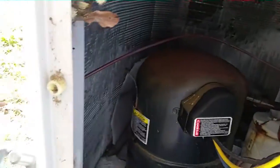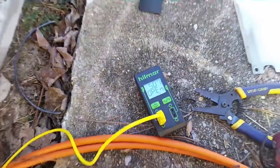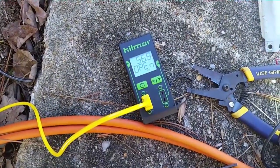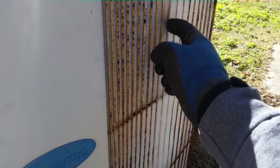There's still a lot of ice on the outside just because it's accumulated so much. On the inside you can tell some of it is falling down. We're getting up near 50 — let's see what happens. Still got a lot of ice on it, might need to go around one more time. It's not really touching the coil — that might be one of the problems. The ice has kind of separated from the coil where it melted, creating kind of a thin sheet. We're up to around 60 degrees on the clamps, should be coming out pretty soon.